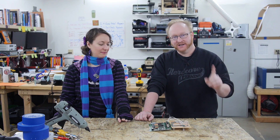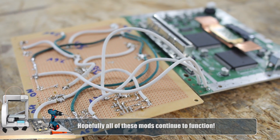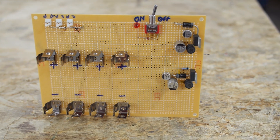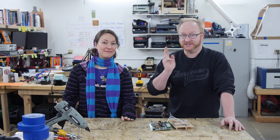That's all the time we have for today. So far in this project we've rewired the memory expansion at 90 degrees, created a 12-volt and 3.3-volt circuit to power this using 7.4-volt lithium-ion batteries, and started working on the LCD and doing other tests. In our next episode, we're going to work on rewiring the cartridge slot at a right angle, attaching the controllers, and finishing up the battery charging circuit. Have you ever modified a console? Tell us about it on the Element 14 community at element14.com/TBHS.